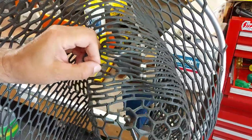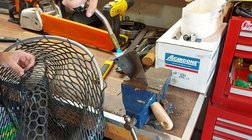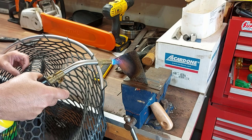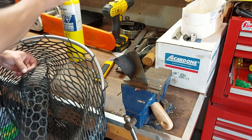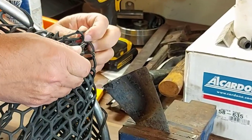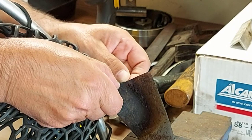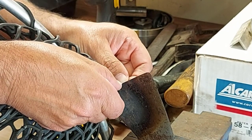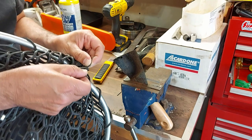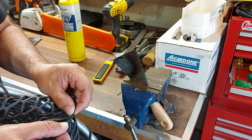Now that I've had about six or seven repairs, I'll go ahead and mend some other joints like this one here. We'll heat up our scraper one more time, just to show you again. Now we're going to grab the two parts we want to melt together. If we do this in a timely fashion before the blade cools off, we should be all right. Stick them together and hold it like that for 20 to 30 seconds. I'm telling you, this really works well — you can pull on that mesh and it holds. It's so cool.